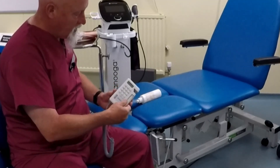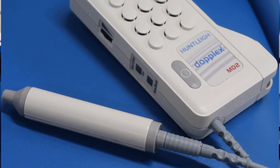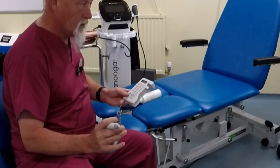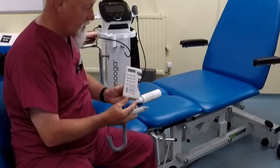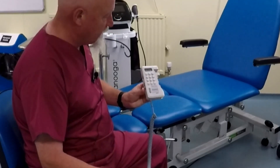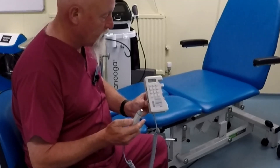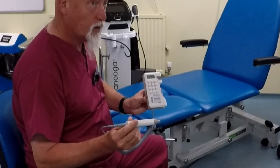This is the handset. What you want to do is remove the probe from the handset before turning it on — you can get some nasty feedback if the probe is too close to the part that produces the sound. The on/off button is right on the front, and when you turn it on the display will light up. You'll see a little probe on the display that tells you which direction the flow is in relationship to the probe.